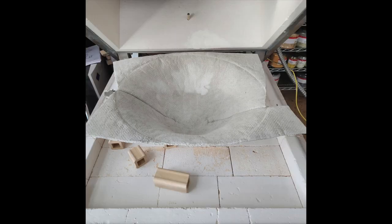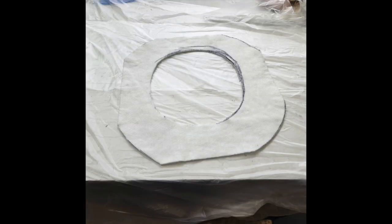The mold itself had some openings on the sides. We could have cut a piece of glass in the center — that would have been a little over 18½ inches — but Larry wanted to keep the full 22-inch blank that we had fired. So we scratched our heads and said, let's see if we can put a donut around the outside and attach that to this form, and then we'd have the right form and shape to support the glass so we could fire it. We fired another sheet of silk mat, cut it into a donut shape, and that donut shape slipped over the mold and gave us support. That was our thought, and it worked out perfectly.